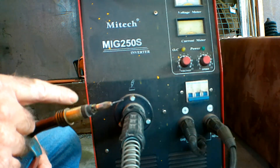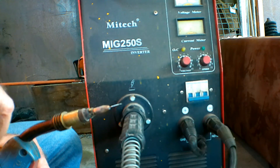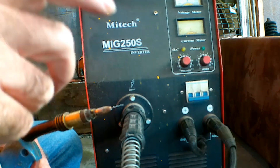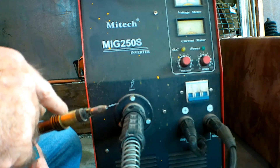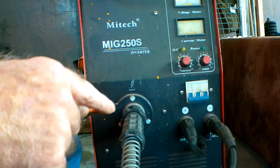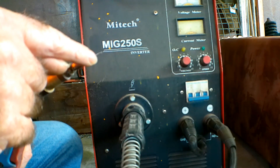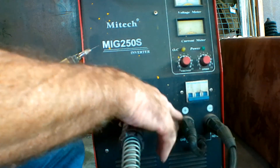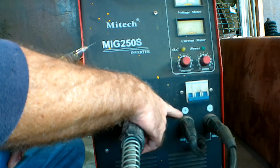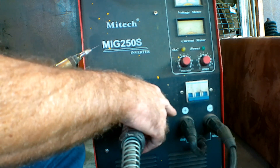So what it basically means: you have your welding torch here, and the wire coming out of it is what they call the electrode — same as arc welding where your electrode is the stick. On a MIG welder, the electrode is the wire. So what I'm basically saying is you want the wire negative. As normally set up, the wire coming out of your torch is set to positive.